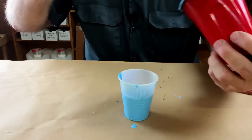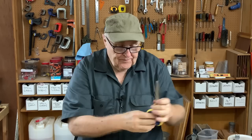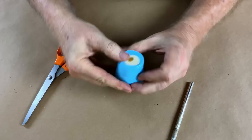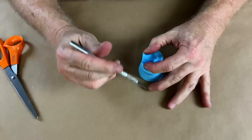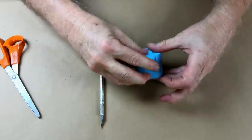Let's let that sit overnight and we'll cut it open to see what we get. 24 hours later, this thing is ready to go. Let's cut it — a little cosmetic trim of the mold to make it look a little prettier. The funnel should pop right out, and it did. Everything came out. Brand new X-Acto blade, razor sharp — very helpful. Because the part is so thin and so delicate, we want to find the top and cut down the skinny side, cutting clean right at the part. And it came right out.